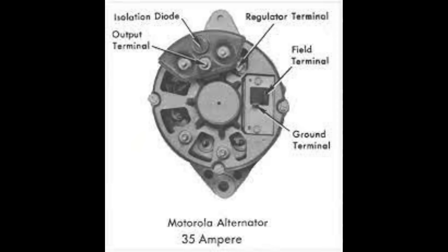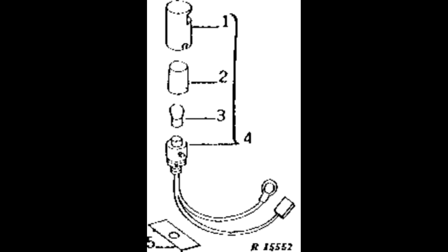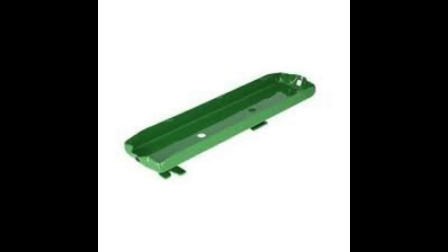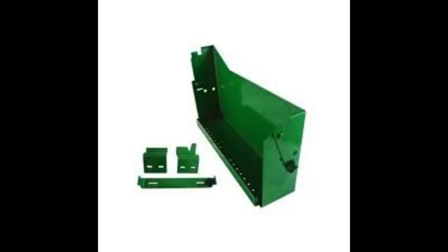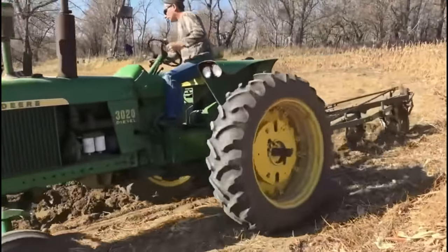Moving on to the electrical system, John Deere changed it from a 55-amp to a 35-amp alternator. The instrument panel would look a little different too, though nothing too major. One cool fact is that the 4000 dash lamp is unique to this tractor — with a built-in ground wire, it only fits the 4000. Another change was the batteries: to save a few dollars they removed the cover that protected the batteries and left the trays open. While those covers on the 4020 do protect against rocks and mud, they are also known to corrode from battery acid. To save more money on the electrical side, only one light was installed on each fender.